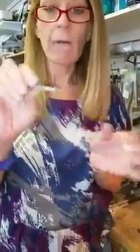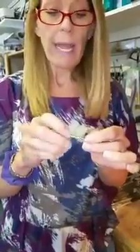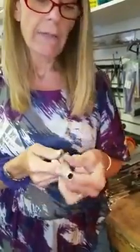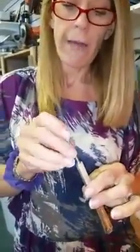It's not easy to work with the nut by itself, so I put it onto a bolt, the same size bolt, M5 by 0.8. You're going to have to find the knife handles with the smaller openings, and you want to round it out as much as possible. How I did that was pressing in the punch. If you can't get it opened enough, you can always set it into the vise and hit it with a hammer to get it round enough. You want to have a really nice round opening, and you want quite a snug fit.